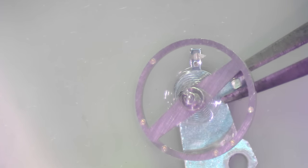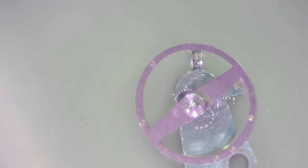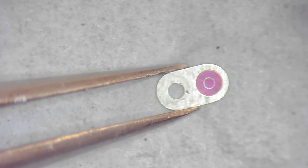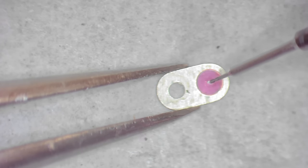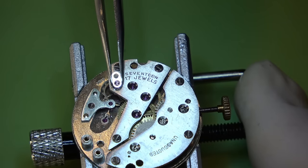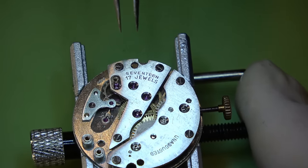What you can see me doing here is taking off the balance spring — there's a brass pin holding the spring in, so I was trying to use tweezers to push it out, but it wouldn't budge. I did manage to get it out but it was off camera. I'll show you now oiling this jewel — just a tiny spot into the middle. This capsule is easier to get in and out. On the balance spring there are two screws underneath, so you need to take the balance wheel off, do those screws, and then reassemble. Again, just like the gold plating, the camera mostly filmed the back of my head.